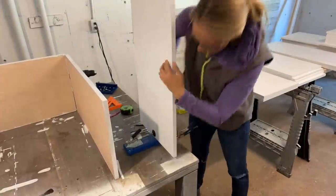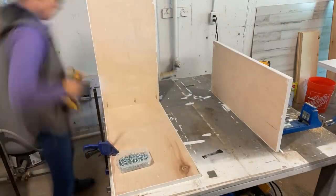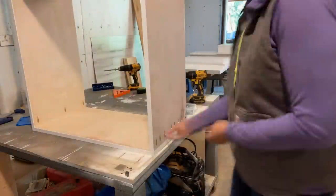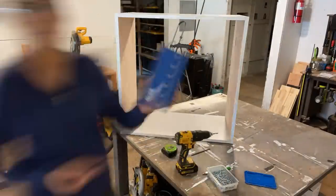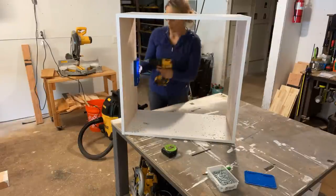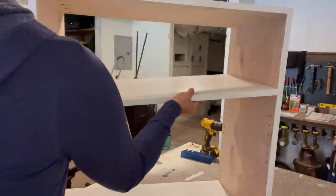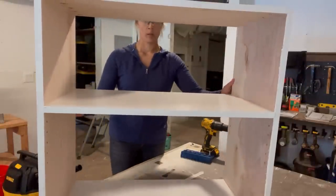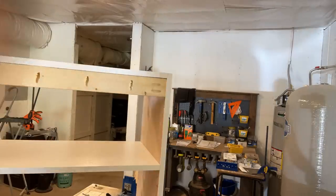I put a bunch of pocket holes in the bottom shelf of the carts — I probably overdid it a little bit, but I wanted that to be super strong. I'm not using glue here just because I may take these apart sometime and repurpose them. So far they're holding up great and we've put a lot of weight on them. I'm adding some holes for shelf pins using a jig — this was my first time using it and it was super easy. The shelves from Shelf Help are a little tight, so I may rip them down about an eighth of an inch. And then you just want to add a base support at the back for extra support. That's the basic shape of the cart — I'm going to add some casters and a back.